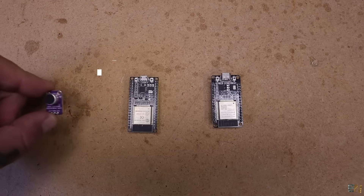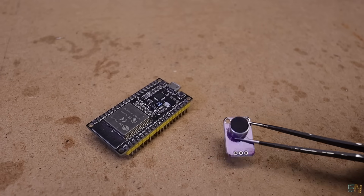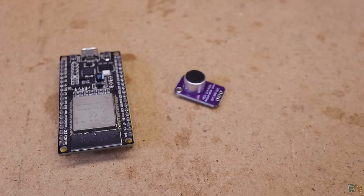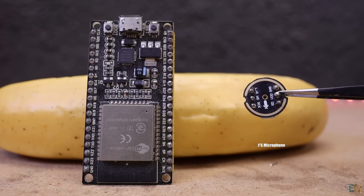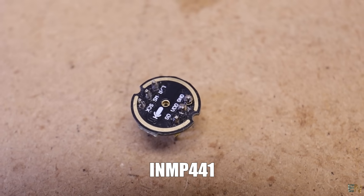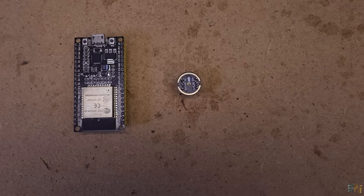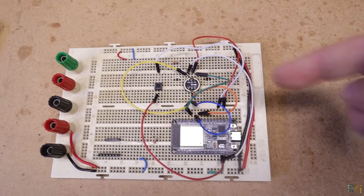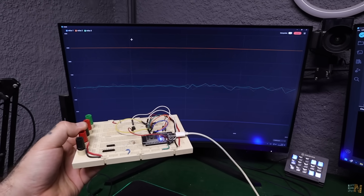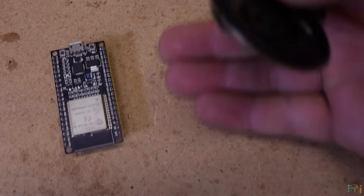Check the schematic and part list below. I need the ESP32, a microphone to get the sound for the transmitter, and an amplified DAC to create sound at the speaker of the receiver. I first tried the ESP32 ADC with a normal analog microphone module but the quality was so bad I had to change my approach. Then I found this I2S microphone module, the INMP441. I2S is like I2C but for sound — connect it to pins 18, 19, and 21 of the ESP32. To test it, make the I2S connection, upload the test code, and run the serial plotter — you can see the plot of my voice, so the I2S microphone works.